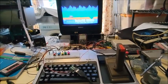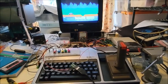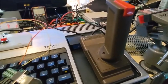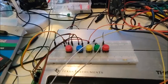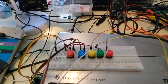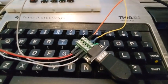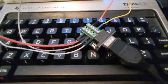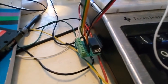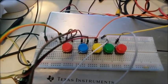More jankiness with my Texas Instruments TI-99/4A. I actually now have a Commodore joystick connected, and it just requires five diodes for joystick one. The pins are slightly different, so we've made up this little adapter using two nine-pin connectors — one going to the joystick and one going to the TI-99/4A — on a breadboard with the diodes.